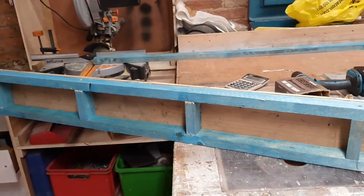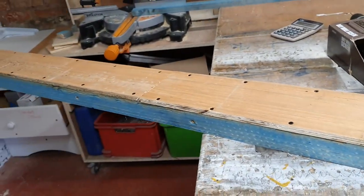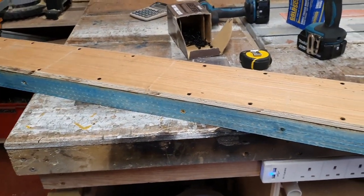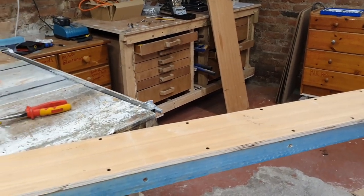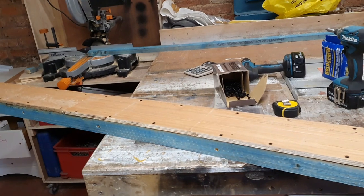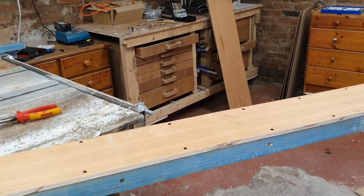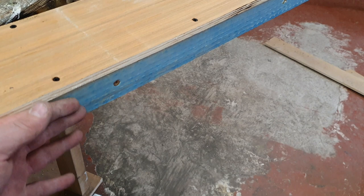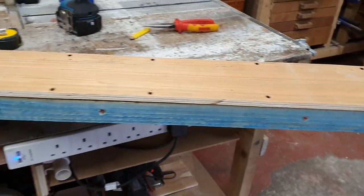This is going to be a little shelf which will sit at the back of the cooker and the fryers. We're going to tile it, and this will prevent fat and grease running down the wall behind the cooker — it'll all get caught on this section where it can be cleaned very easily without moving the cooker out every evening. I just need to put a face section on here so we can take the tiles around the corner, and then we'll take it next door and put it into position.